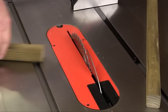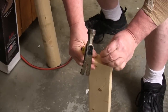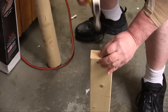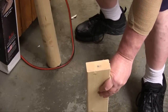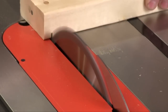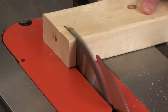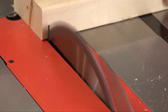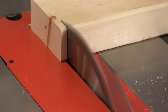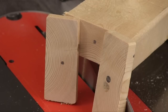But remember, if we get to a very wet spot, it could fire the brake. Some think that just hitting a piece of metal within the wood will automatically trigger the SawStop brake, but that's not true. If you're touching that metal when it hits the blade, your signal could get transferred to the blade and initiate the braking. For this first cut, I have bypass mode engaged. Because I'm not touching the nail, we can cut right through it and bypass mode doesn't detect anything. This time the full braking system is armed and we'll cut through the nail again — and we go right through and nothing happened. I wasn't touching the nail so SawStop didn't see any change and didn't deploy the brake.